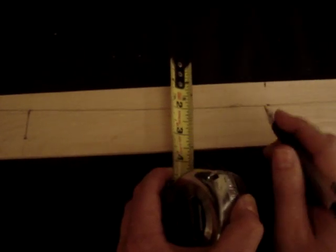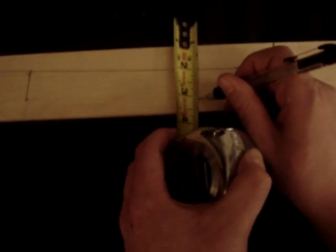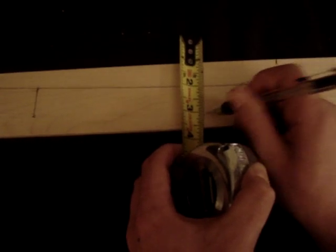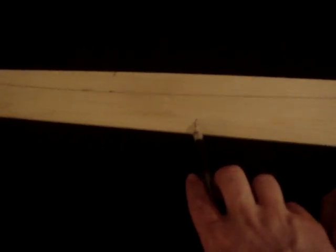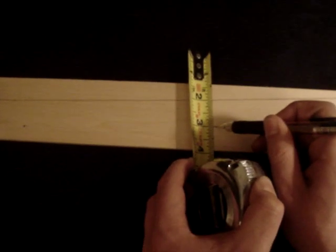And we're actually going to want half of 1 1/8 and 1 1/16, which is going to be 1 inch and 3/32. There's 1 1/8 and 1/32 less is right there. And then the same thing here. Half of this, half of that. It's right about in here. In this case, we want half of between 1 inch and 1/16 and 1 inch, which is going to be 1 inch and 1/32. So there you have it.